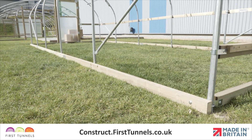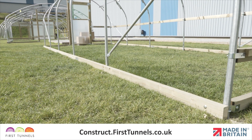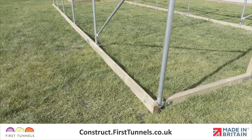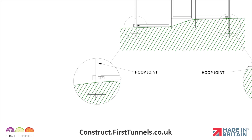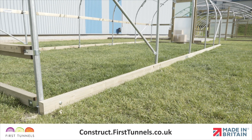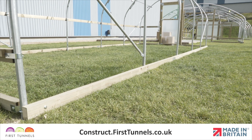We can now fit the base rail on the opposite side. If your ground is not on a slope, then repeat the procedure you followed for the first half. If you have a slope across the width, fitting the rail on this joint will create an unnecessary gap. We advise setting the base rail at a height that eliminates the gap as much as possible, but still ensuring that the rail from the door post to the corner hoop is level. Ensure that the rail is at a consistent height — a string line will be handy here.